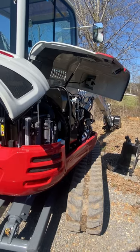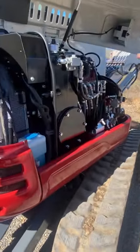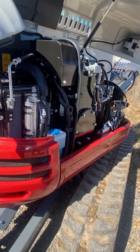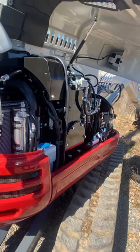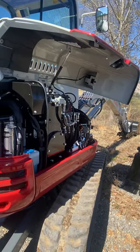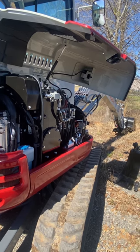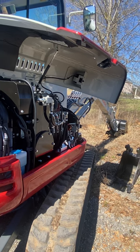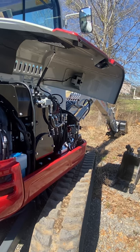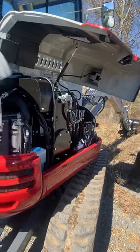Washer fluid for the windshield wiper. Hydraulic oil level is here. I always kind of overfill it to begin with, and this is the way you check it — with everything positioned so you're hiding as much chrome as you can. That's about as low as you can get it sitting on flat ground: boom cylinder down, dipper all the way out, bucket all the way out, thumb closed. As long as you've got that ball floating, that's all you really care about.